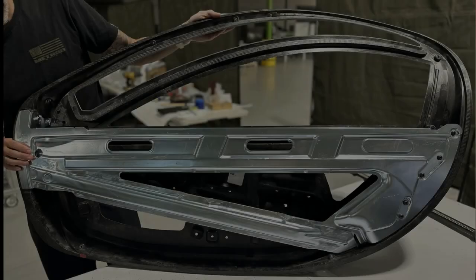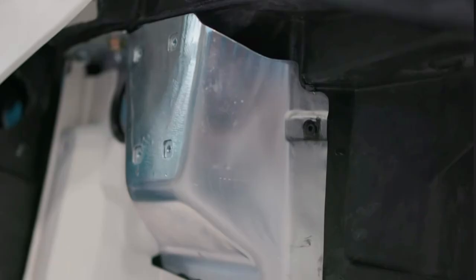These soft tools don't affect the quality of the part produced, but they do affect how many parts can be made from the tooling. This is where I think Aptera has gone to build the metal reinforcements for the body — the crash braces. The Isuzu was built in the early 2000s and technology has gotten a lot better for these ceramic body dies. Now you can usually stamp tens of thousands of parts out of one ceramic die, as opposed to where Isuzu was only able to stamp a couple thousand.